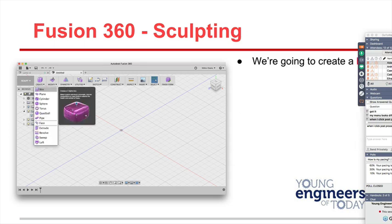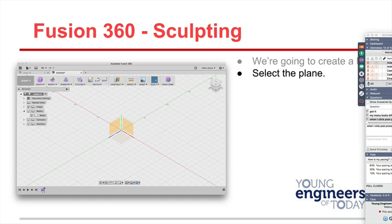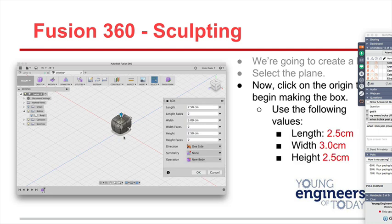So then we're going to create just a box. It's called a T-spline because you move in all these different directions. It's more like sculpting. Select the plane, the bottom one there, looking like in your default position. Blue and red right there. And then go ahead and enter. Then you're going to make one length 2.5 centimeters or 25 millimeters, with 30 millimeters or 3.0 centimeters for the top. And just hit OK once you've done that.